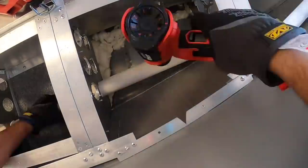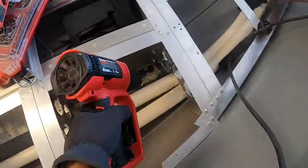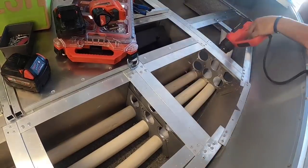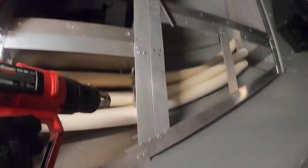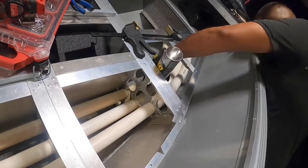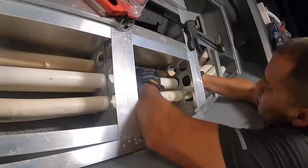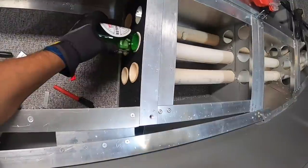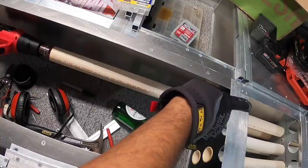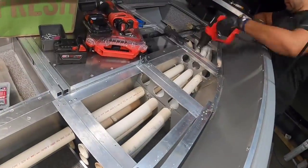The bigger key to these tubes is constant heat. The thing about PVC is if you heat it up it stays hot — it doesn't like to let go of heat. If you heat it up on one end and then the other end, it retains the heat. Then you can heat along down the side as needed. Constant pressure on the heat gun and they will eventually curve and bend to your will. We are sealing off the ends with quad foam because we are going to be pouring into that pocket — dual pockets poured — and that will solidify the tubes from ever moving again. If you heated it too much though, it would just fold and it was a catastrophic failure.